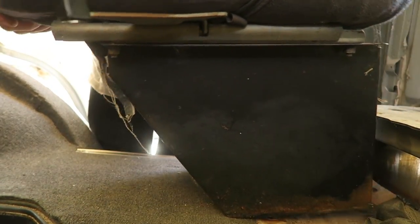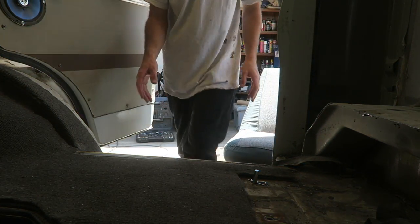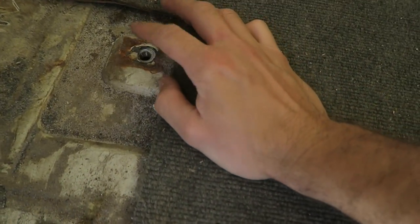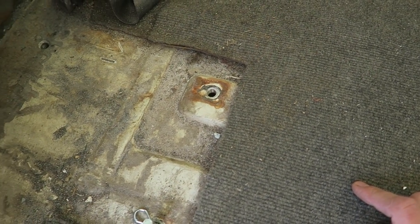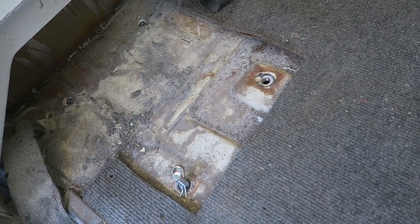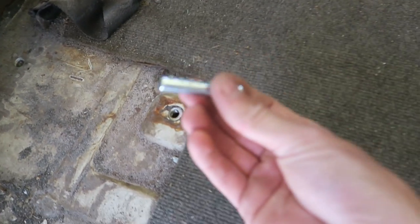Let's take a look at what it looks like right now. Here's kind of my idea - do you see the stud? I just shoved the stud through the bottom of where the bolts were at, where the seats were bolted in before, and I'm going to weld that into place in all four locations. Drill some holes and hopefully this thing comes together nicely. It should be strong enough - I'm not worried about the seat breaking off or flying out. I mean it had some rinky dinky little bolts in it just being regularly mounted, so I think these will do just fine.